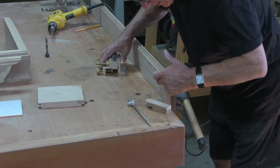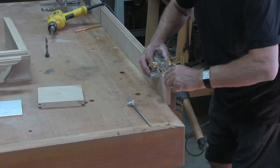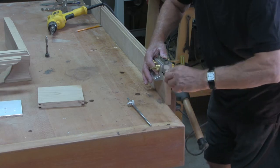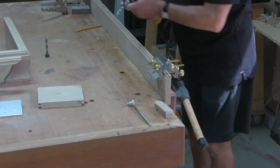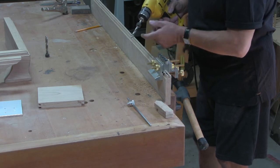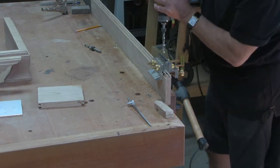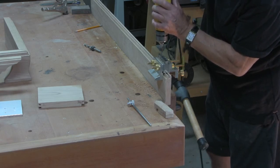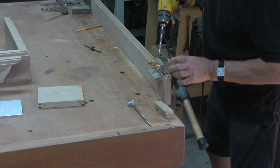The number two is here and the number two is there, so we reverse this — make sure everything's tight. Now with this one, you'll recognise there's a mortise here for the stub tenon, so the depth is three-eighths, meaning we have to go to a longer drill setting by an additional three-eighths of an inch. Take care when you first hit this part — it doesn't tend to bite, so just take it easy on that part.